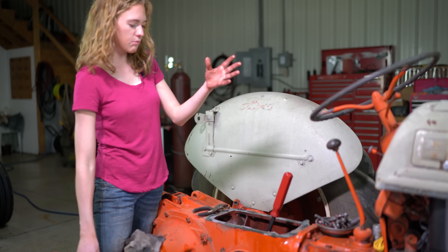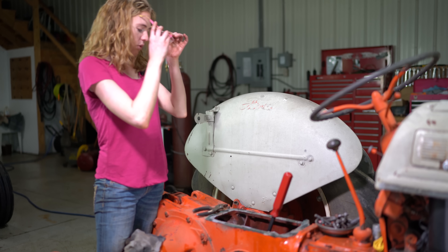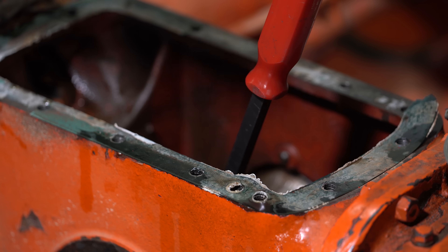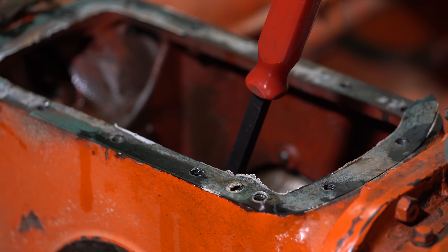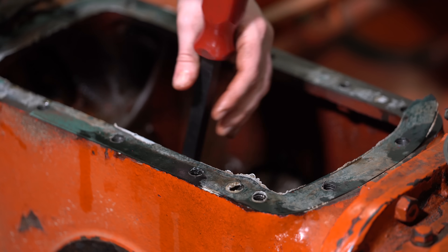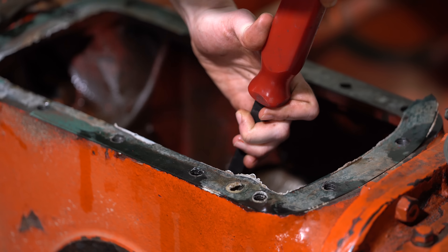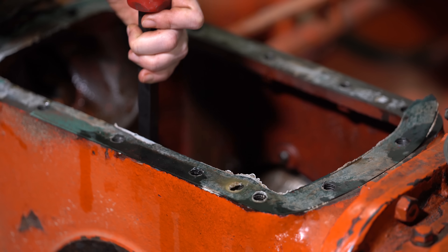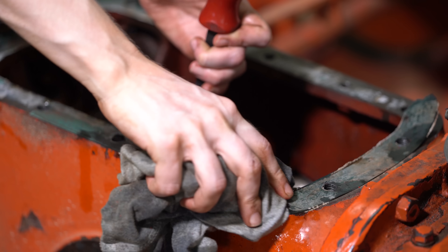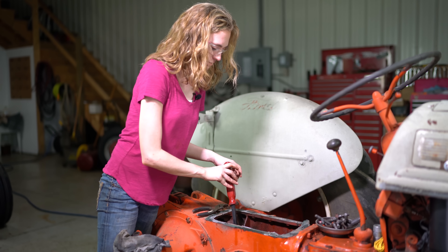The PTO will be going around and oil is going to be shooting up, so be careful. Make sure everything's out of the way, wear safety glasses, and have a rag ready. I did add a little bit more oil to the system so there's enough to shoot out. I see a little bit of oil coming out, but when I move that control valve I have nothing — no change. That indicates to me that the pump is indeed bad. We'll go ahead and figure out exactly where the problem is with the pump, and next we've got to drop it out of the bottom of the tractor.